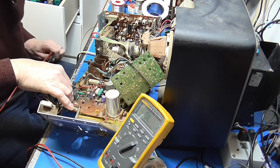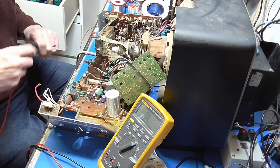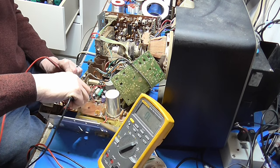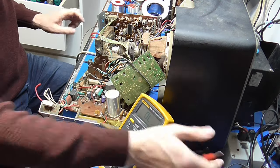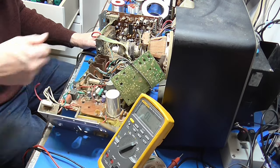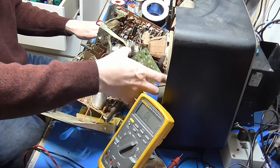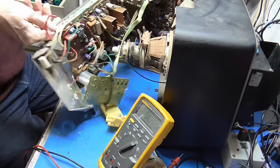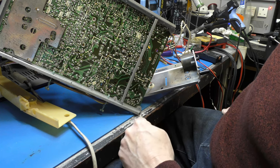We've got this big capacitor here. It is entirely possible that that has failed short. Have I ever measured between the collector and ground? There's a diode there, which is probably that diode. Okay, yeah, of course, that wouldn't bother us anyway, because we'd had a load on there and it lit the lamp up and the power supply wasn't making that awful row to suggest it was under some sort of unpleasant load. So what else have we got around the line drive stage?